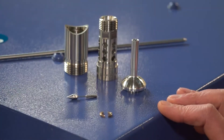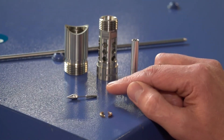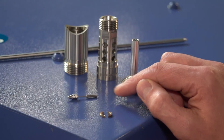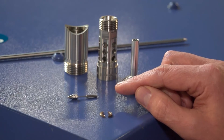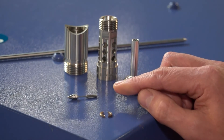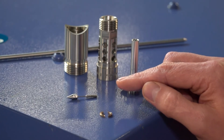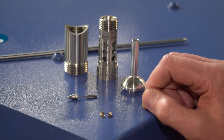Tell us about this final part. This is a needle valve pin — it's made in one hit. We actually make this from round bar, so we balance-mill the hexagon, balance-turn it, and as you can see there's a 0.8 mm diameter in the middle, which would make that pretty much impossible to do on a fixed head machine. It is flimsy and you could probably bend it in your hand, but again, because of the guide bush technology it seems to be almost limitless how small a diameter you can produce. The thread on the end is M3.